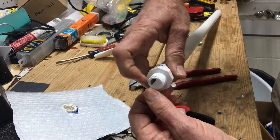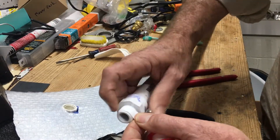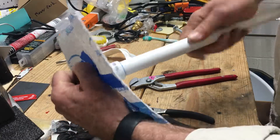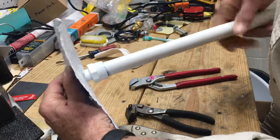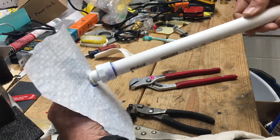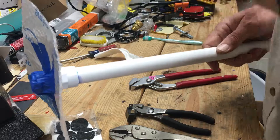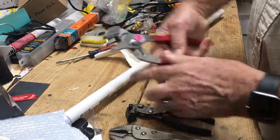What you also don't want to do is let the tape hang over the end, because then the water would force it through and into your shower head, which could wreck those holes. Once you do it correctly, smooth it down. You've already got your beauty ring on here. Screw it in hand tight — really hand tight. Make sure you don't cross-thread it. You'll know because it will go in a full two or three turns easily if you have it straight in. If it's cross-threaded, it'll start acting weird — back it right out and make sure you're straight in. Once you get it hand tight, you only need one turn, or at most two more turns, and that's it. Otherwise you might damage something behind the wall. Those extra turns after hand tight are where your pliers come into play.